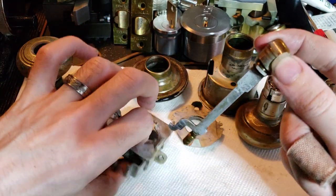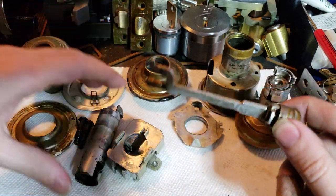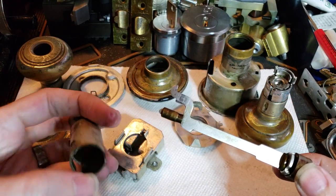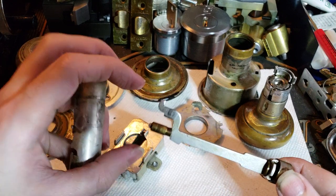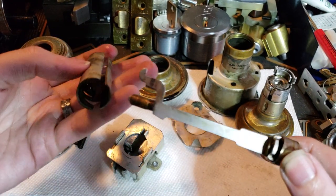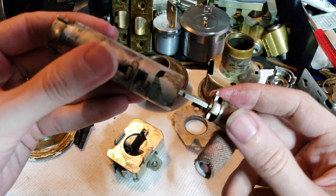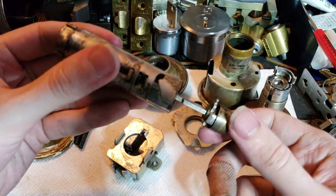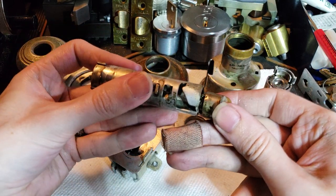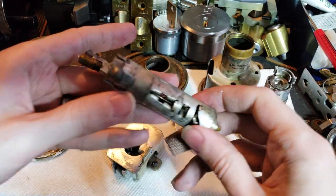We have the privacy latch, and the big difference between this and the later versions is this little hooked bit at the end of the tab. It still assembles basically the same way — you have two sides of the knob, one with a little tab and one without. The one with the little tab needs to go into this sort of J-shaped channel, because that is what will hold it in place.